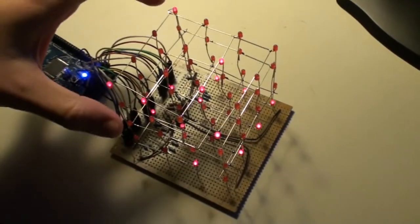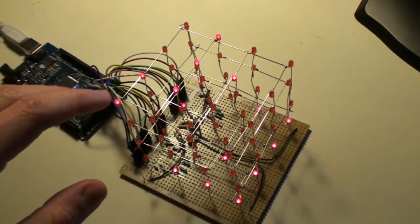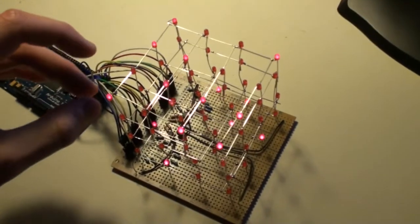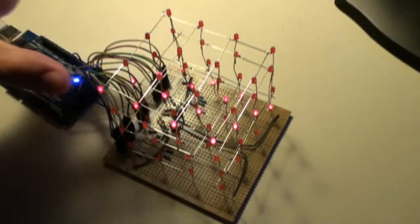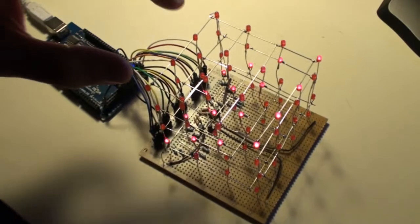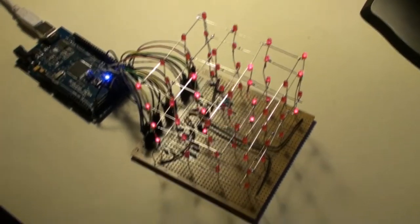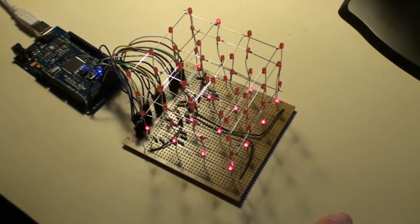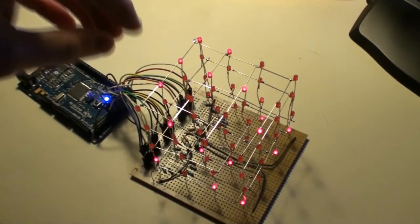With this project it is only a single color and we haven't enabled PWM yet. It would be possible, but it would require at least 16 PWM pins. The pin count could definitely be reduced by connecting the LEDs in another type of grid, but that would make it more difficult to assemble, so we decided to go for the easy solution and have shown you how to do that in the guide. We will probably soon make a bigger version, and also an RGB version with multi-color LEDs.